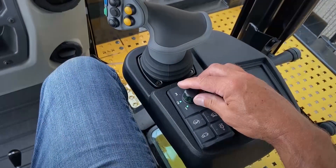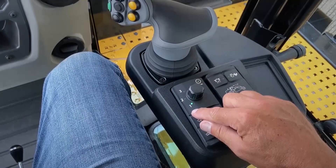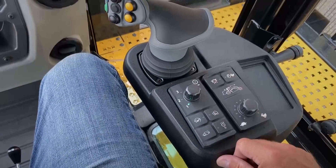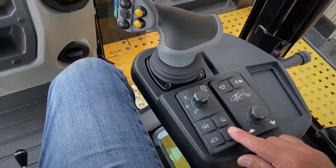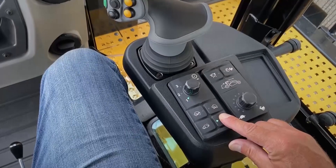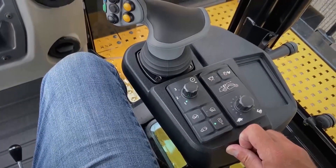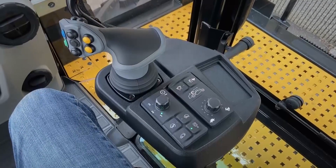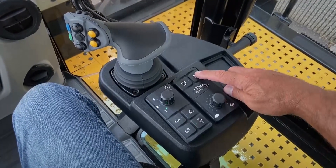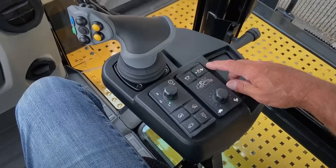Select your rotor speed using the rotor speed dial. Here we've selected speed number one, which is recommended for the initial cut. Simply push and hold the rotor activation button until the pilot light lights — the machine will check and then engage the rotor. You can now set the engine speed to working speed by touching the engine speed button; it lights the pilot light to signify that the engine is in working speed.